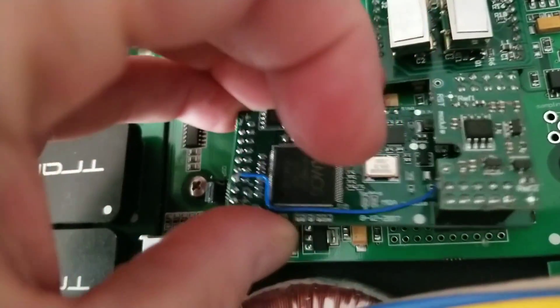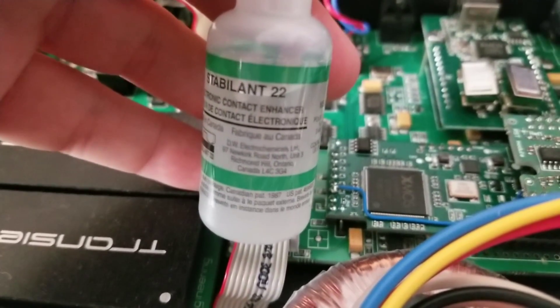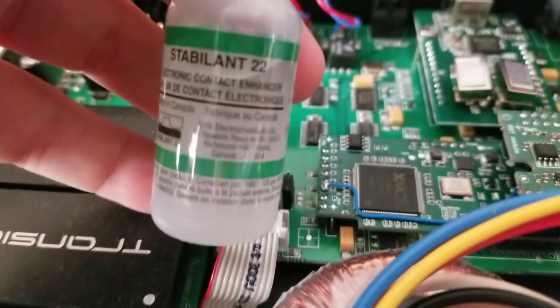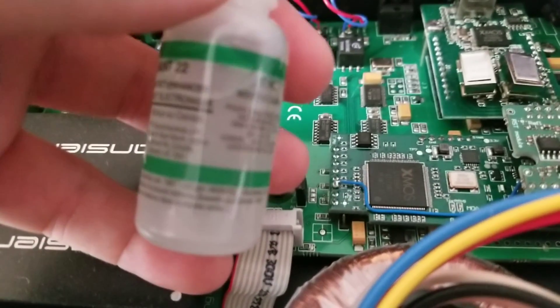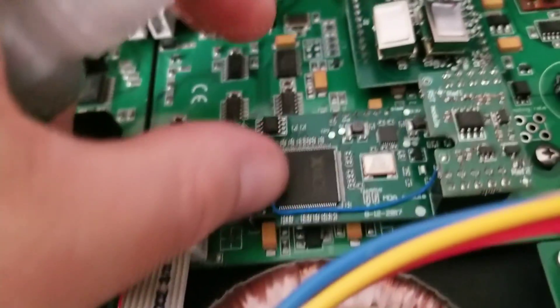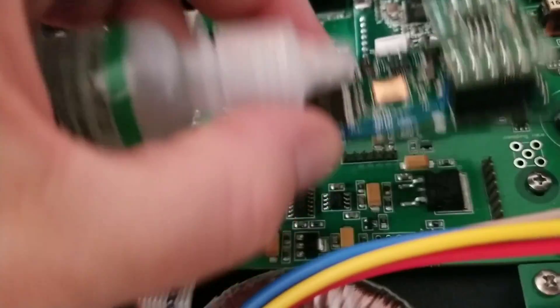Then we come in with this module and we're going to align it. Check this out — this stuff is bad to the bone. This is not audiophile BS. This is Stabilant 22. It's a compound used by NASA and avionics companies — they put it on the back of avionics instrumentation. It enhances the contact surface area and creates less resistance at the interface. So what I'll do is apply this first to the pins using these little brushes that come in the kit.